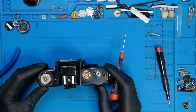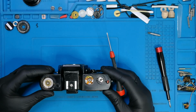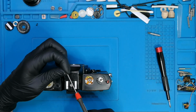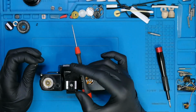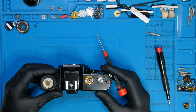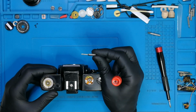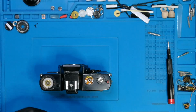If you have the possibility, only use JIS screwdrivers for Japanese cameras. JIS comes from Japan Industrial Standard, I think, and it looks like a Phillips screwdriver, but it's not. And also the screws, if you take one and look really carefully, you'll see that the slots are slightly shifted, so it's not a cross, it's more like a shifted cross somehow. Many times it doesn't make a difference, but sometimes it really does. This one is a Phillips screwdriver, 00, because I broke my 00 JIS. I still have one spare one, but I need to find it. This one is JIS, so I use a combination.